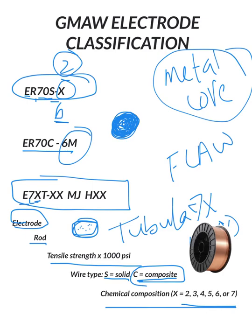That's why they copper-coat solid MIG wire — remember that's for solid wire. Flux core wires are not copper-coated; they look like steel and have the flux on the inside. After the T, we have a couple of numbers — it could be 1 through 14 — representing usability, polarity, gas shielding, or self-shielded designation.